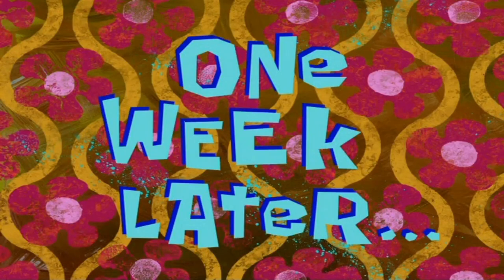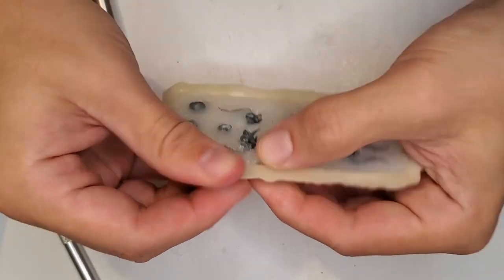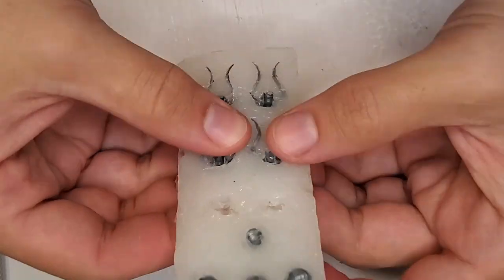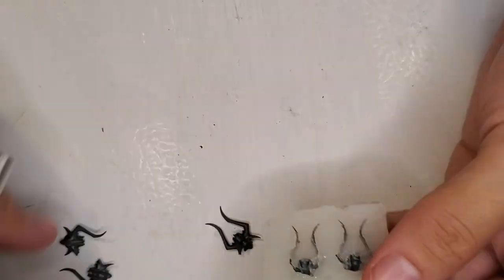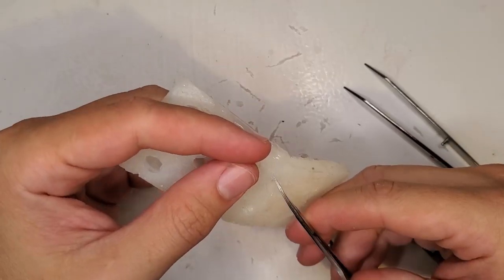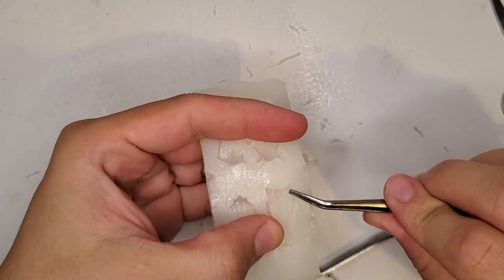One week later. Separating the mold from the retainer requires a gentle touch. Silicone caulk doesn't have the kind of flex that platinum cure silicones have, so it's a slight bit more delicate. For that reason, we trim off all the overhangs and the little bits of flashing on the edges — not just to make it look pretty, but also it protects the mold, because little loose bits are generally where the tears start to form.